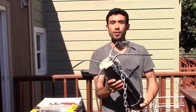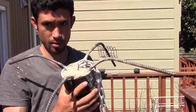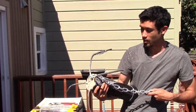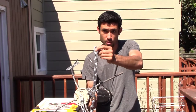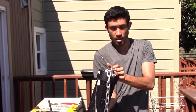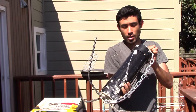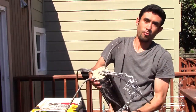This is the completed anchor. I poured the concrete inside and positioned the anchor points in relation to each other, and there's a chain in the middle. The idea behind the chain — as explained in more detail in the original video — is that you attach your rope to your boat on the end of the chain, and you connect the chain with a zip tie to the top of the U-shape. If you get hung up on the bottom of the ocean and can't move, the zip tie will break and you'll be able to lift the anchor straight up, freeing you from any snags.